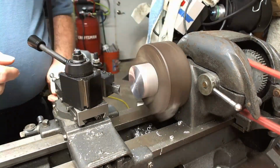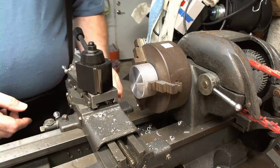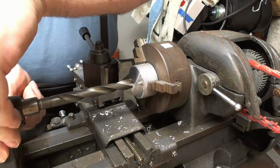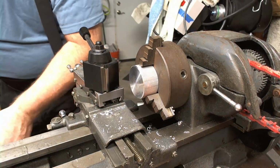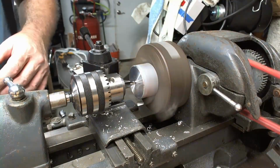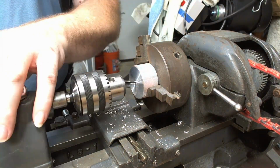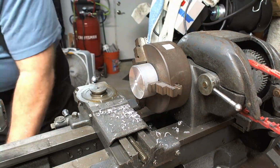So I think it got really hot on the one side where they cut it, because when I played with it later in the drill press, it was really hard cutting through the first section with the drill, and that was interesting. So first I just realized, like, okay, don't use the big bit, use your center bit. You know this, you haven't done it for a while, but you know these steps. So then I got the center drill out and did that, and then realized I had to get that out of the way in order for it to fit.